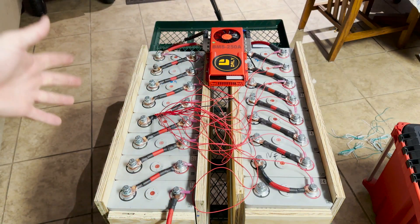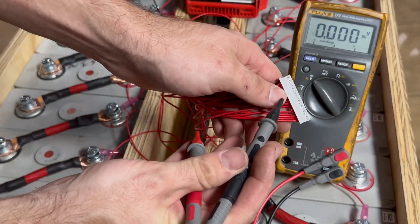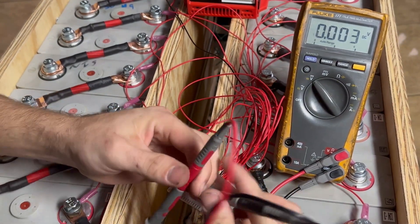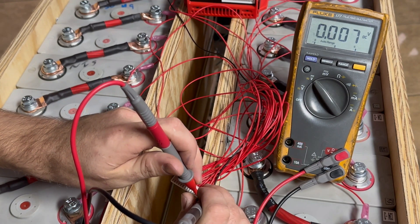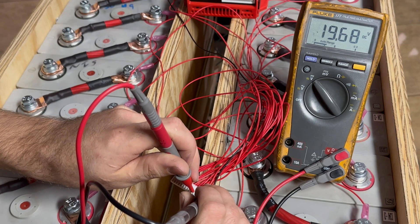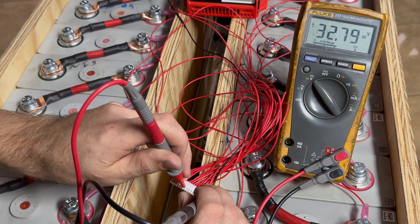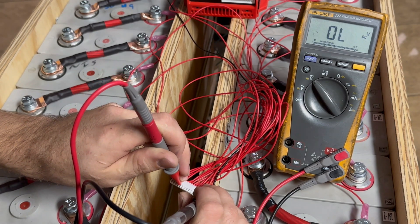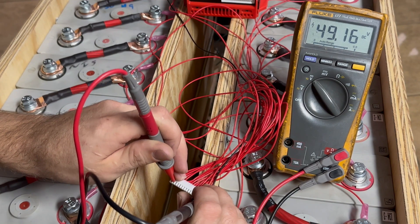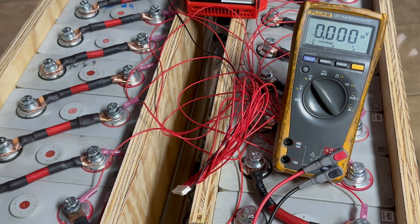We're all done. Now I'm going to get the multimeter and show you how to make sure you did it right. Now we're going to check with the multimeter to make sure we have it all wired right. You have all these little exposed pins — you're going to start with the negative one, and you just go over and you should see it jump in approximately three-volt increments, essentially your cell voltages. So: three, six, nine, thirteen, sixteen, nineteen, twenty-two, twenty-five, twenty-nine, thirty-two, thirty-six, thirty-nine, forty-two, forty-five, forty-nine, and fifty-two. As you can see, it constantly ascended. We didn't have any spots where it went dead or read zero, so that means all the cells are reading correctly. That's what you want to see. Make sure you check that before you go plug this into your BMS.